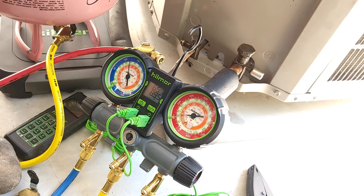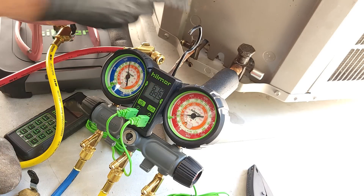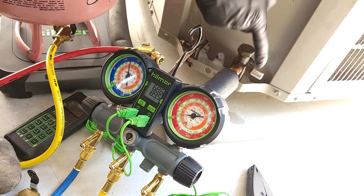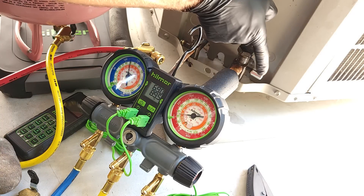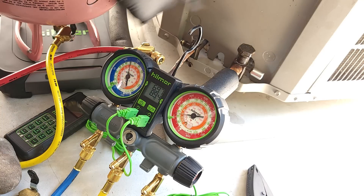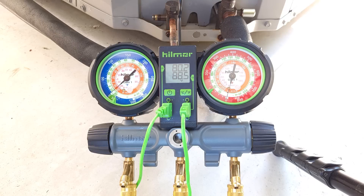After I turn this system off, I'm going to check these valve cores right here to make sure they're not leaking any refrigerant. These caps have o-rings in them — they are made out of metal with an o-ring and a metal cap, so they should be able to hold in any pressure if the valve core was leaking, but I'm still going to do that test. The small amount of pressure left in the gauge set is just low pressure vapor that can be vented — that falls under the de minimis rule. You also want to make sure that you're EPA 608 certified before handling refrigerants. A universal certification or a Type 2 cert would suffice because this is a Type 2 system.